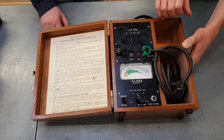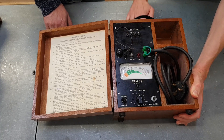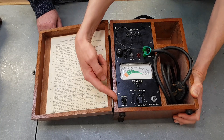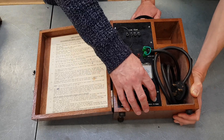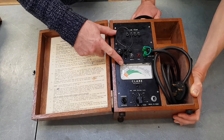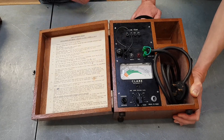You had to set the voltage to the right level you were testing at, so you'd probably have done another test beforehand. At the time it was quite common for voltages in different properties to be different, rather than the standard 230V we have now. You've got a forward and reverse toggle which relates to what you're actually testing. The scale at the top is read off directly, and the orange region indicates a fail — unless it's on a TN-CS or PME circuit, in which case that region could be a pass. So you have to actually know what you're testing.